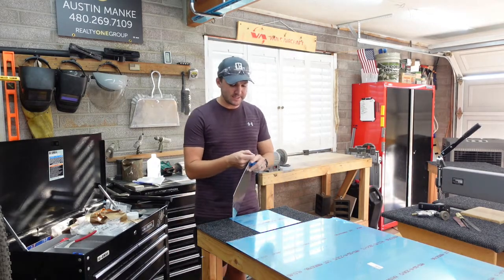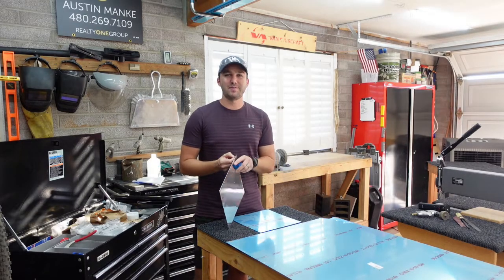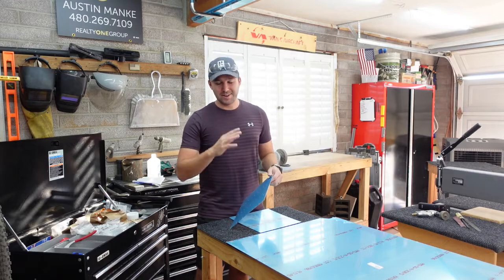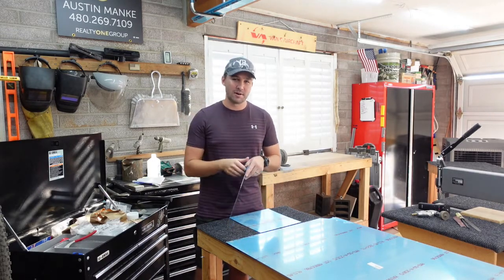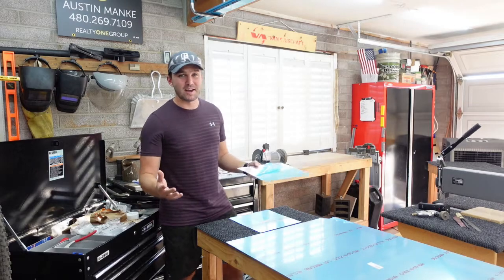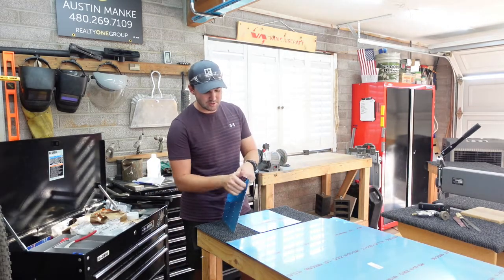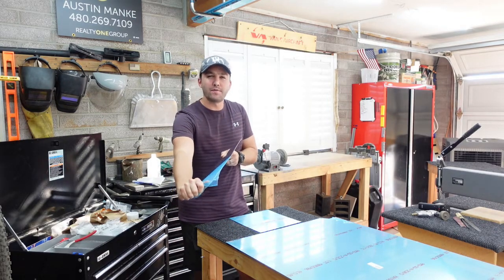So voiceover real quick. What I'm talking about on camera is basically just mentioning how I am changing how I process things. Well, not really changing how I process material, but deburring ahead of time, even though it's not noted in the plans to do it right then and there. So this part that I'm talking about on camera is a part that's sandwiched between two other layers. So I'm deburring the edges now ahead of time versus running the risk of any scratching or anything like that down the line.